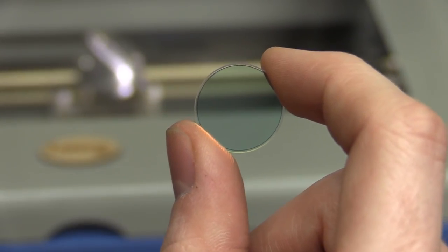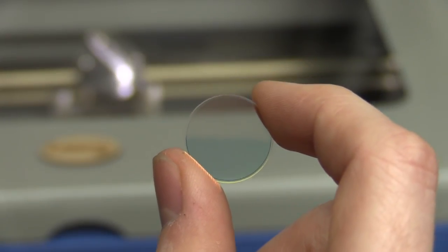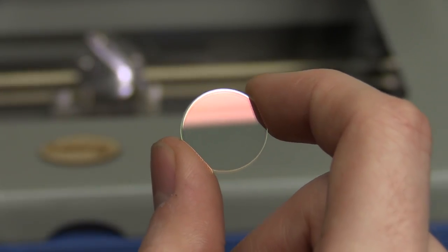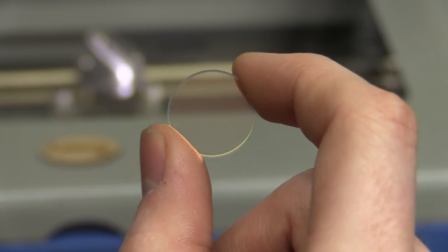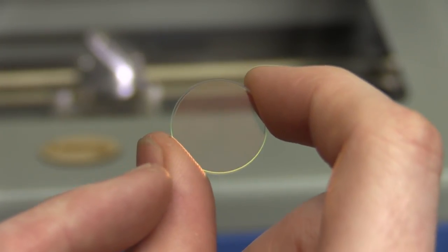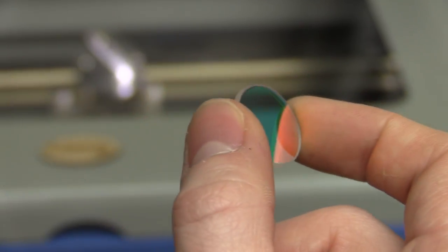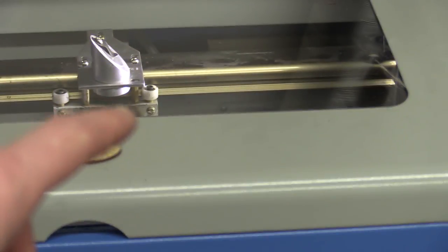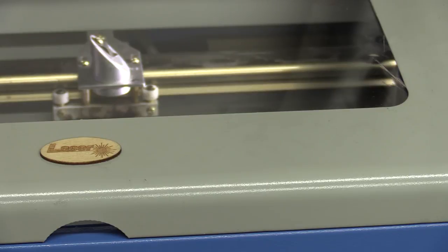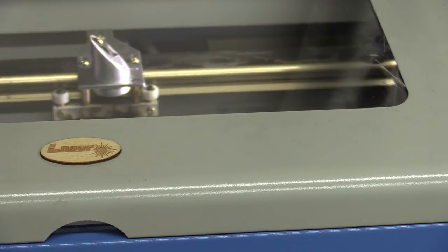You might be able to see if we look through it that it has a blueish-green tint, and that's because some of the red light is reflected. There are actually quite a lot of materials that act like this, but mostly it is the other way around — transparent to visible light and reflecting ultraviolet or infrared light, like your regular glass or acrylic. We can easily see through those, and when we try to cut with the laser, the laser beam cannot pass through so the material gets hot and that's why it gets cut.